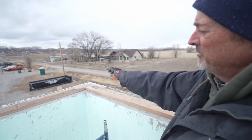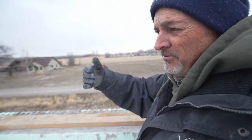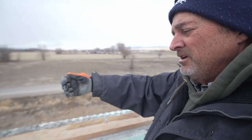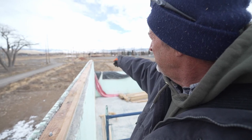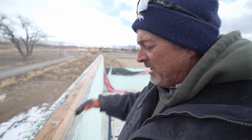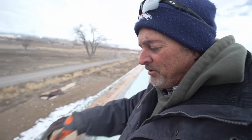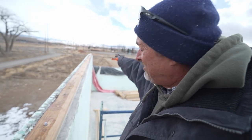So I've already done a measurement from this corner here. That piece there is right up against the edge of the blocks. So that's as far that way as the trusses are going to be able to go. And I've measured all the way down to where I think the wall is going to be built, the load support wall or the load bearing wall. I put a board down there that'll be basically the top plate of the wall, and I've got it lightly bolted in. I'm not bolting anything hard to these bolts yet because the concrete isn't really done curing, but I've taken a measurement from,